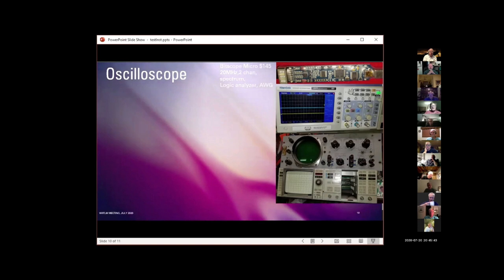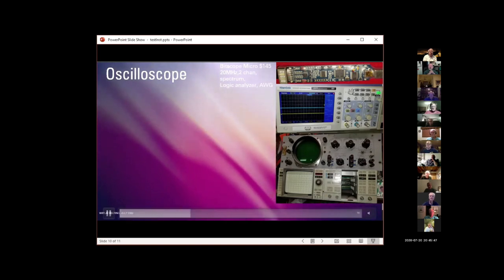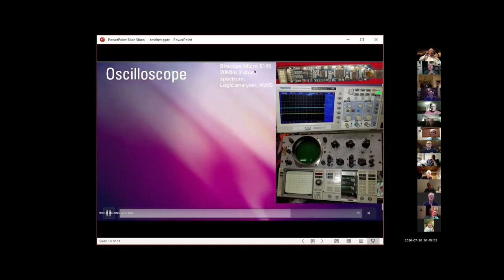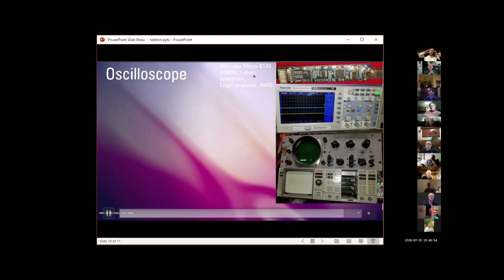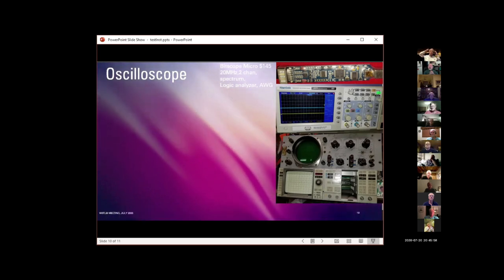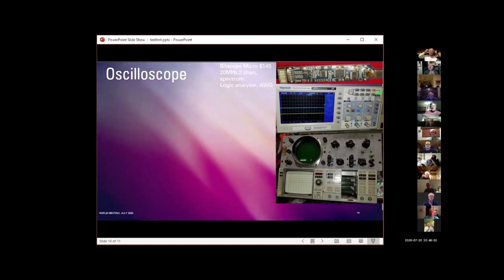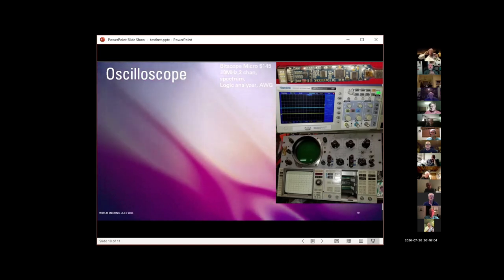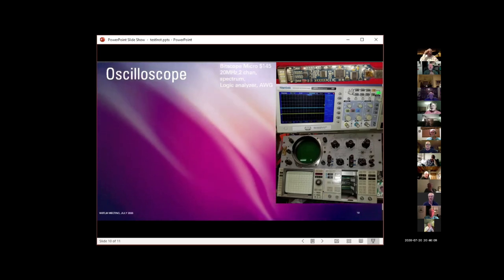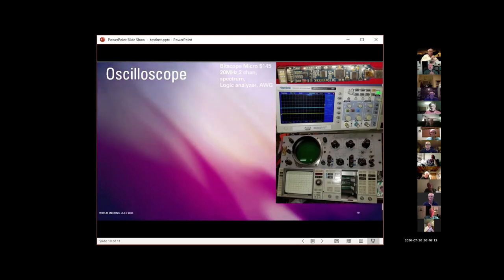However, if you want to get into oscilloscopes, this little guy, the BitScope, is $145. It's a 20 megahertz, 40 megasample per second. Samples per second is one of the key characteristics of a digital oscilloscope you want to know about. Spectrum analysis up to about 20 megahertz, an 8-channel logic analyzer, and an arbitrary waveform generator.